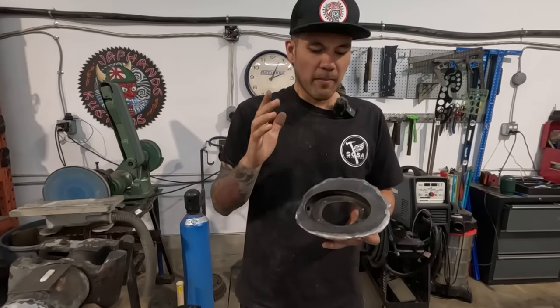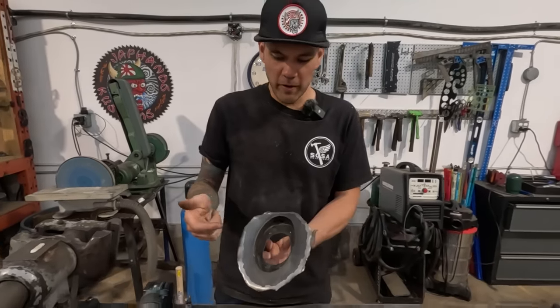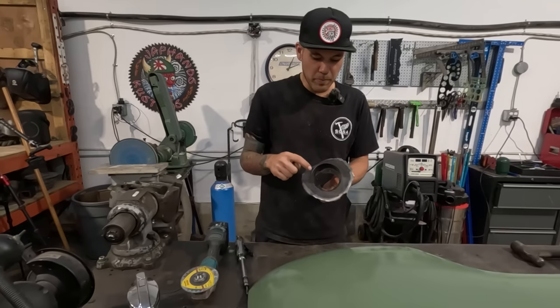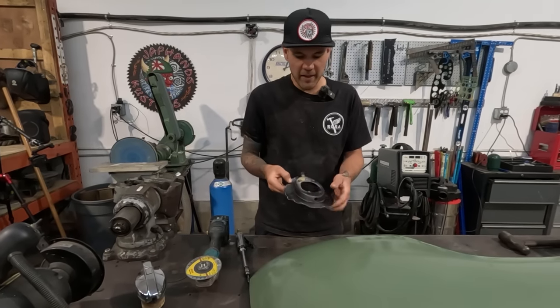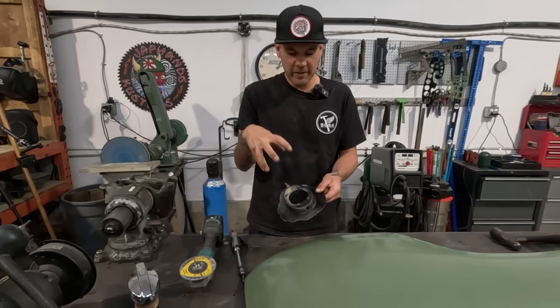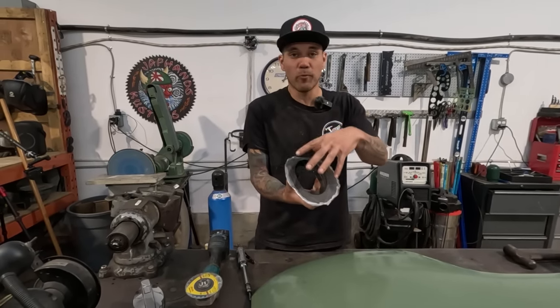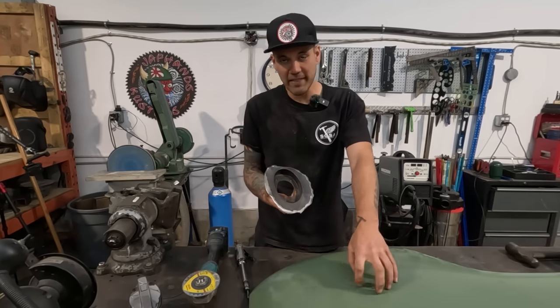So my thought past that was, okay, well, how could we flange this sheet metal to be this oval shape and then just use this stamped piece and slip it on the backside, like basically mimic exactly what they did here, but in this fender already.